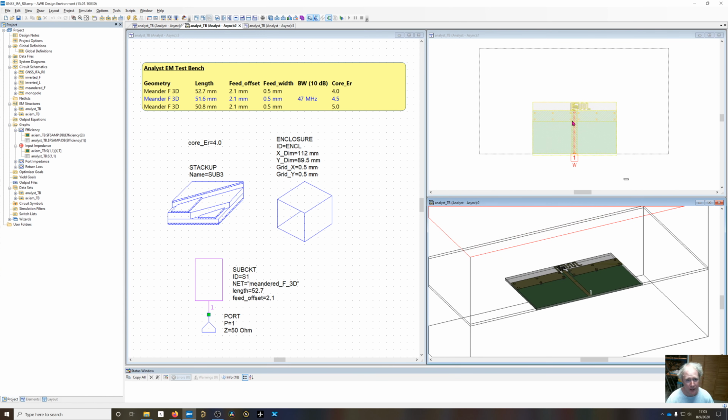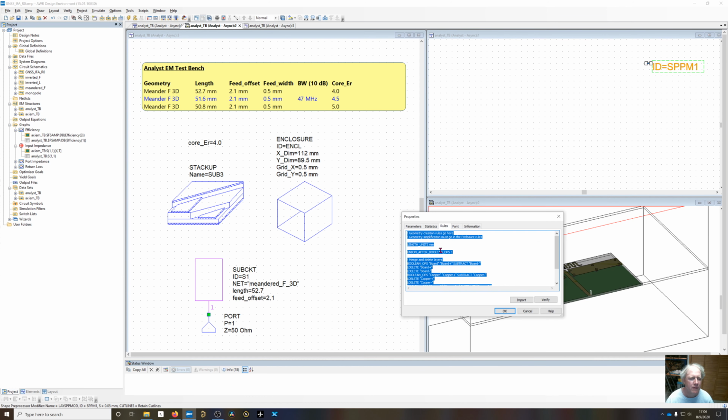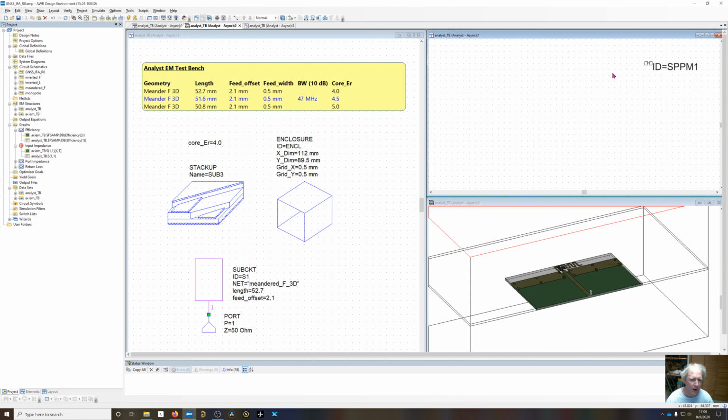And that's what you got to do to get the de-embedding. But I'm still far enough away, approximately 1/4 wavelength, that the near fields, at least for the antenna section, should be away from the boundary condition. And I've also needed to modify the schematic preprocessor right here to add the rules to tell it to add the board back in. Otherwise, that's the only difference between the two, the boundary conditions.